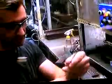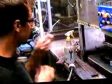With their truss rods in place, the necks move down the line to meet up with a critical part of the guitar, the frets. These are the frets. This is one continuous fret, but essentially each piece will be a fret on a guitar neck. There is a ridge on the end of this fret, and it is this edge that's going to fit down in the pre-cut groove already in the neck.